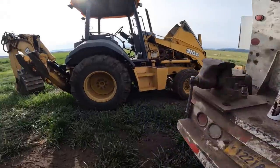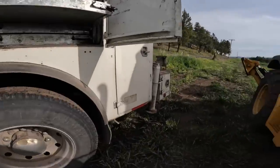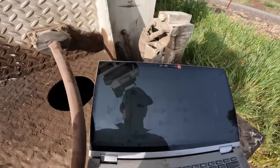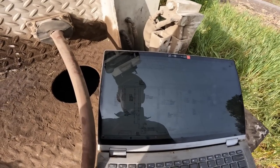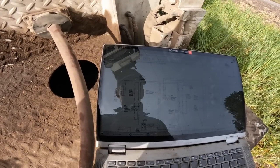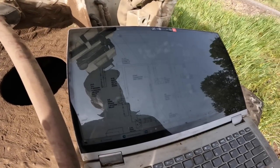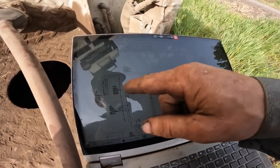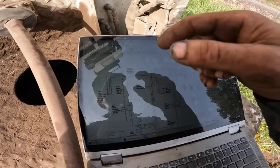So let's look at this. I'm thinking about doing, so that's going straight. Wait a second now. What is there, a wire number? Park brake. J25.8 tan on this side of the diode. EO2C 0.8 white on that side of the diode.